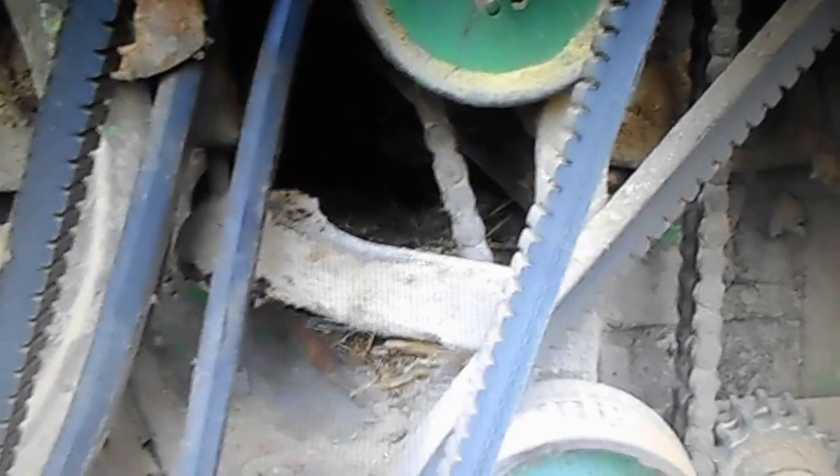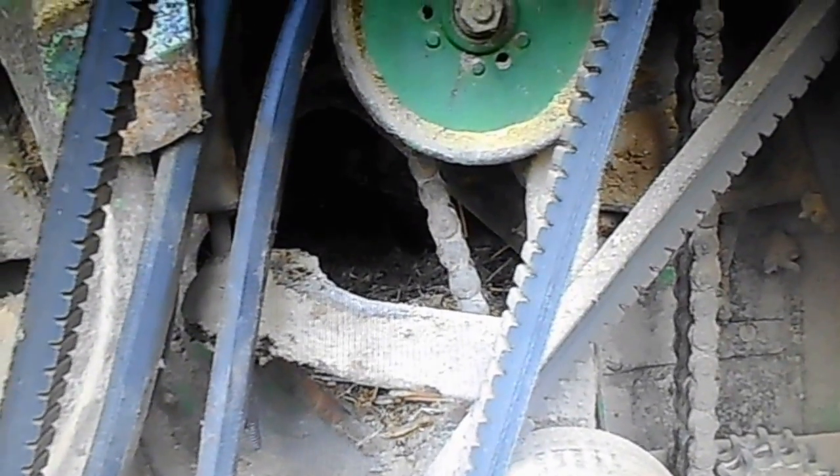There's probably 10 bushel of beans in this thing, even up in the straw walkers, packed up in it. So, did find one problem. The nut for this was just worn out, literally, worn almost in two, thickness-wise in the threads. I'm going to get a new one, put a washer behind it and tighten it up tight like it should be.